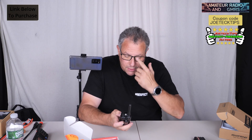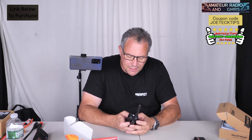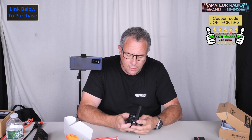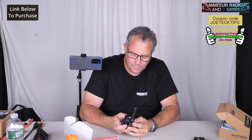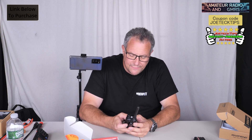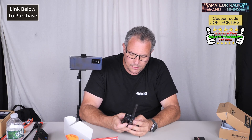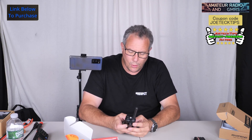When you go to menu, then go to Program Channel, which is the third menu down, and then select the channel name you want. I'm just going to use my club's name, SR725. Once you get out of the menu system, you lose everything. So you cannot leave — you have to enter the full frequency: 4, 6, 2, 7, 2, 5. You cannot leave the menu system; you've got to stay with it and always press the buttons, otherwise you're going to have to start over from scratch.